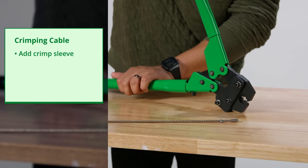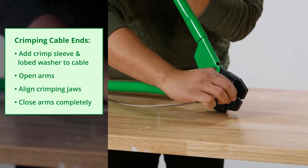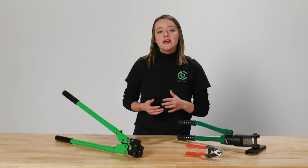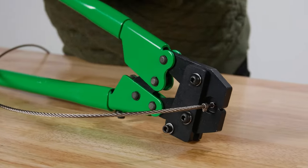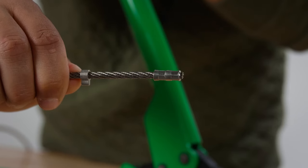To crimp your freshly cut cable end, put a lobed washer and crimp sleeve on your line. Open up the arms, line up the crimping jaws close to the end of the crimping sleeve, and close the arms down. Each crimp sleeve needs to be crimped twice, so you'll do this one more time on the other half. When crimping, make sure you have a bit of a gap between the end of the sleeve and either crimp.